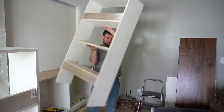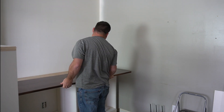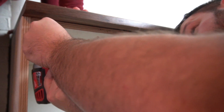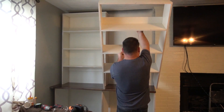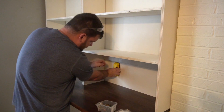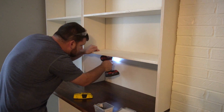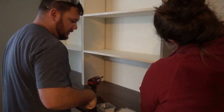Think of this whole project as being built from the ground up. We started with the lowers, the next layer is the countertops, and then the uppers sit on top of the countertops — that's the way things needed to be constructed and installed. We couldn't jump ahead at all because one relied on the other. Since we took the time to level the lowers, everything else was going to be level after that. We put the countertops on and attached them using screws through the underside. Once that was done, we moved on to installing the uppers. The uppers sit on the walnut but aren't really attached to it — they're attached to studs in the wall behind them. The two uppers are also nailed together in the center, and to attach them to the wall we used cabinet screws through that support piece into the wall stud.